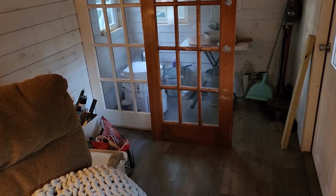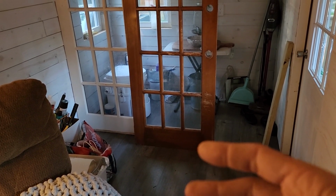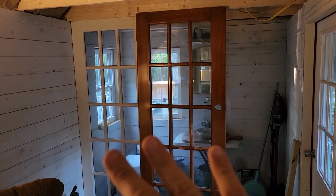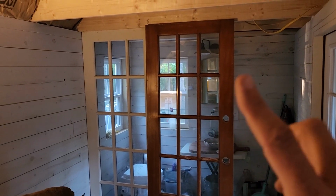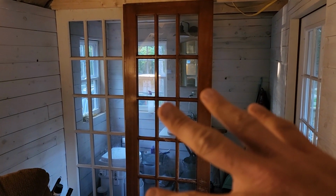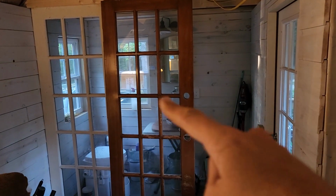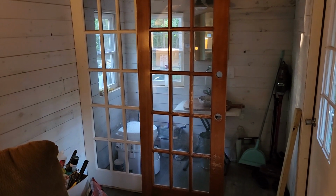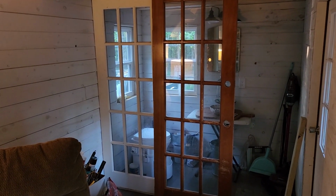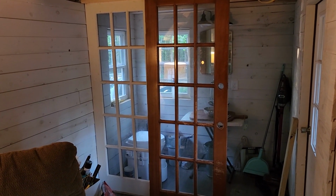And when we cut off the rotted wood at the bottom, we can put a 2x4 or 2x6 there to shore up the door to the floor, to the wall and the ceiling, and then the other one will slide in front of it. The plan will be to get the hardware and figure out how we're mounting the door first, and then we will match the wall piece of the door here. That way the cross beams line up. Again, you won't see through it. It will be frosted or painted, a stained glass type thing, or something else that she'll come up with that'll be cute, I'm sure. But that'll let all the light of those two windows come straight through.